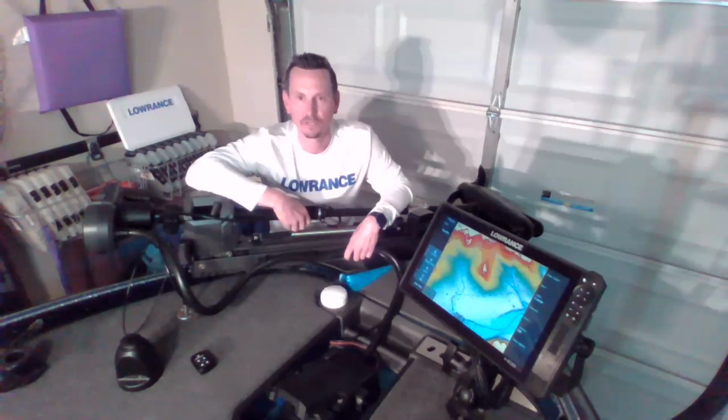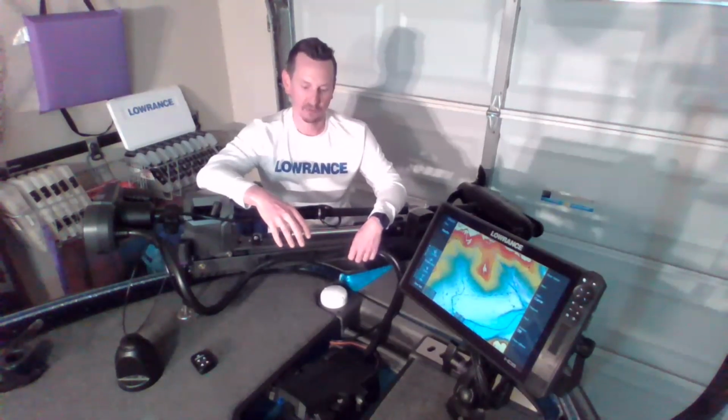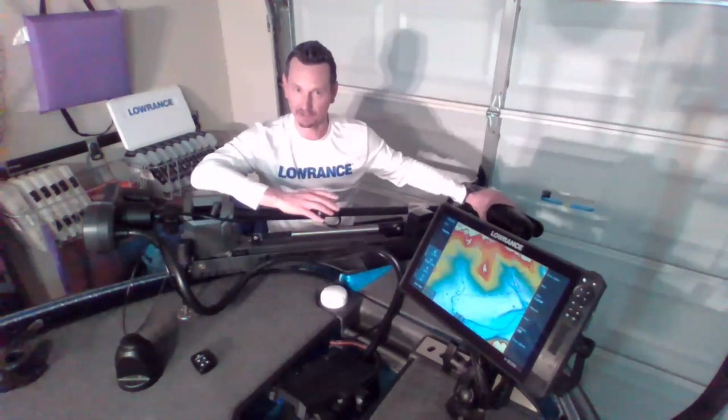So I had a question of, will the keel offset stop the flop? One thing I'll say is, if you have upgraded to the latest software and you've experienced it flopping around on the deck when stowed, you need to upgrade the trolling motor to some software that we've got coming out. And we'll do that through the Lowrance app. Basically, if you're under navigation and you have the trolling motor stowed, it may try to steer. Now, it's not harming anything, but that's probably what you're talking about.